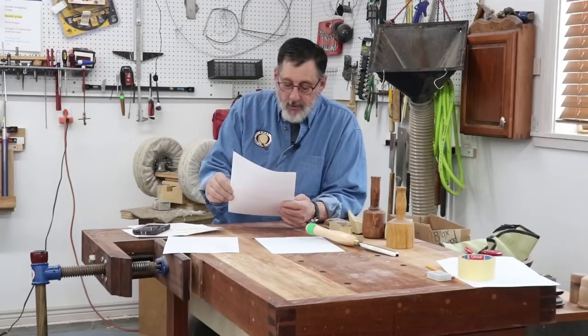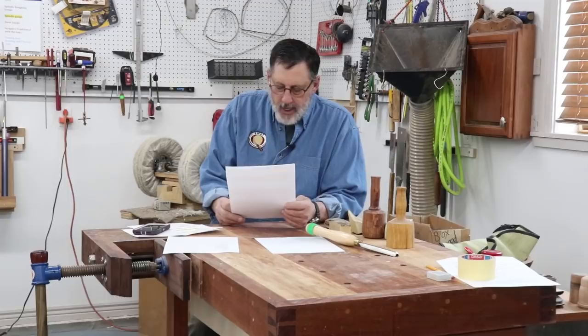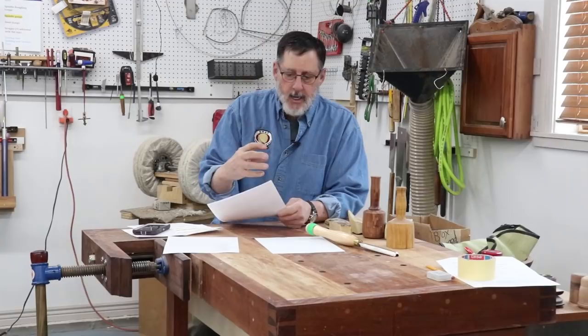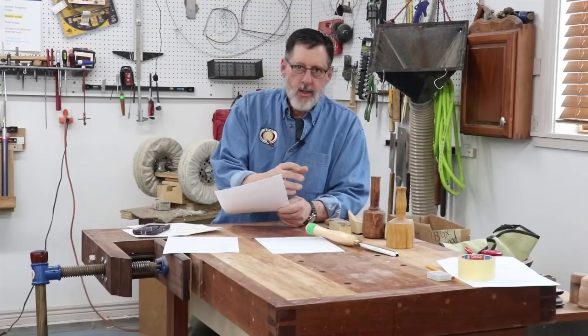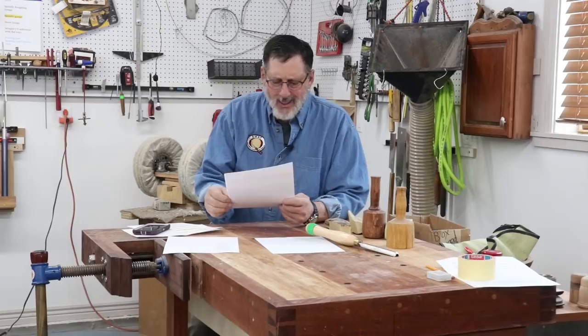Blake said: 'I love the whiteboard drawing.' I appreciate that — I do that off camera and spend hours on my drawings. He asked if I could show the shape and connection points for a jam chuck when turning a sphere. In that video I was turning a sphere and used a jam chuck to finish it off. One thing to note: the jam chuck might be from slightly wet wood. If it's really dry, it's not going to grab onto the sphere as well. You just have to practice — that's what it amounts to a lot of times. Practice, practice, practice.